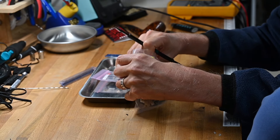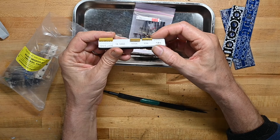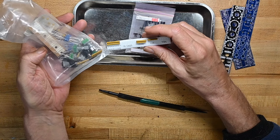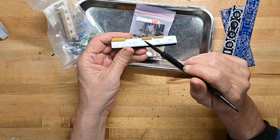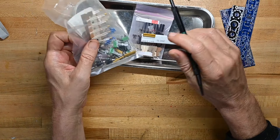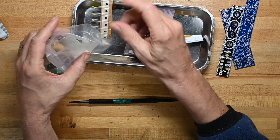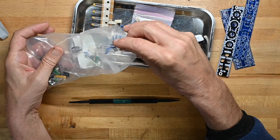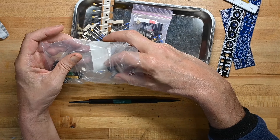There are the chips in their little container, and a power cord. These are inline resistor packs — I thought they were something else. Now, there's a problem: this is where they should have used tape, because four of these eight-resistor packs fell out and they're loose in the bag. I'll have to figure them out. I assume these loose caps are 104s — a tenth of a microfarad. Yep, they're 104s. Not a big run of 1Ks or 10Ks — these are a lot of onesie-twosie resistors. There's a ton of resistors when you add those inline eight-resistor packs.